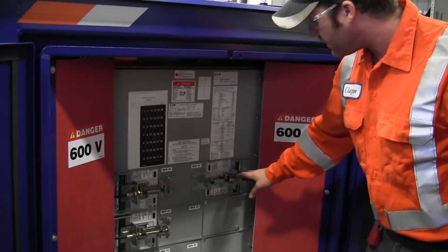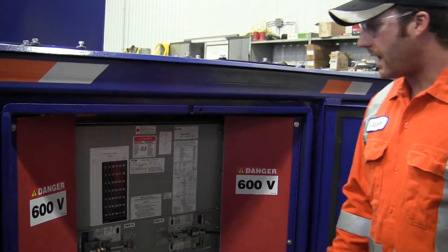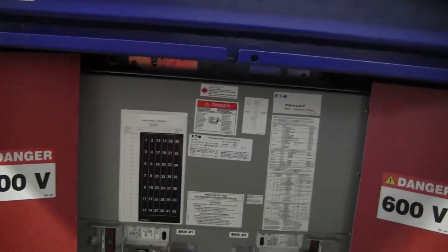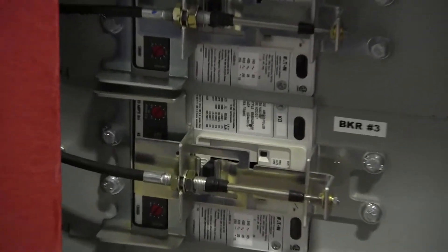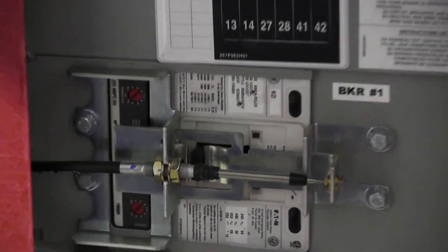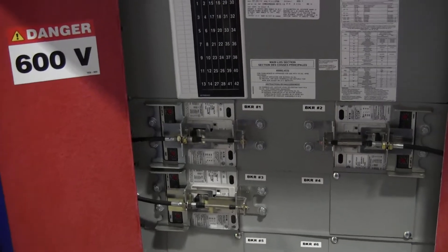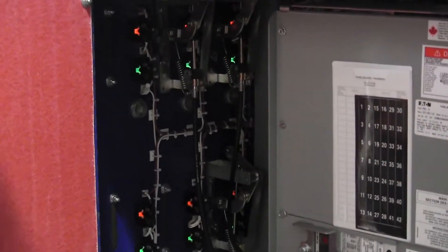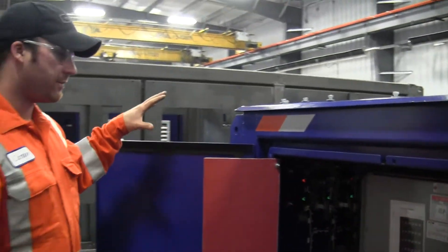These are the flexi shaft mechanisms connected to the handles, which will operate the 600 volt breakers. We have KD style installed in this one. We also do FD style breakers with auxiliaries and shunt trips for safe operation. And we also have indicating lights hooked up with three-wire auxiliaries off our breakers, indicating what position the breaker is in — either open or closed — making it easier to view everything from the control section of the transformer.